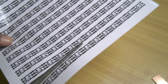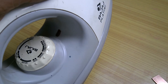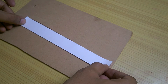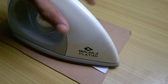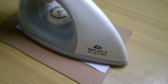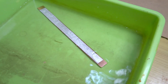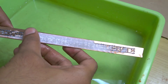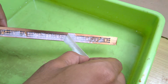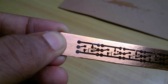Using scissors I cut one strip from the printed paper and heated my iron to its maximum temperature. Using an MDF as insulation I lined the traces onto the center of the board and slowly started pressing the iron. Please take your time and do not hurry during this process, as the toner may not get transferred completely. Then I put the board in water to remove the paper — only using my fingers and very lightly, otherwise there is a risk of removing the toner as well.